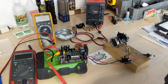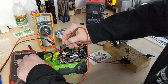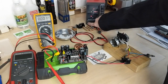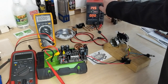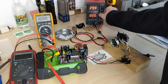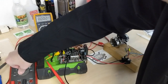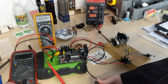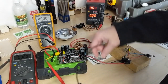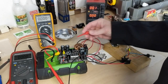I'd be surprised if you can get quite that high with a big differential between input and output. I have this battery right at 50 volts — actually around 51 volts — and I haven't powered this board up yet. I'm going to bring it up on my power supply with the full 30 volts out but with the current limited quite a bit. I have a Fluke 87 in series to measure amps. If I hooked it straight to the battery it would arc as the caps charge, so I'll bring it up slowly.